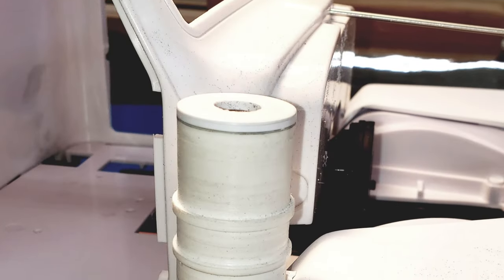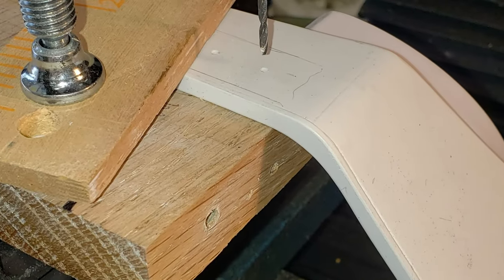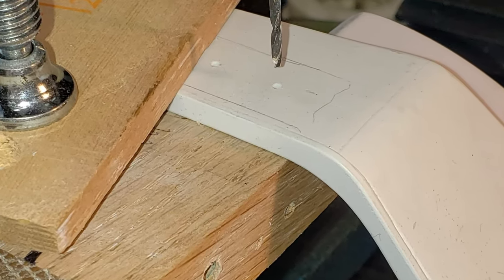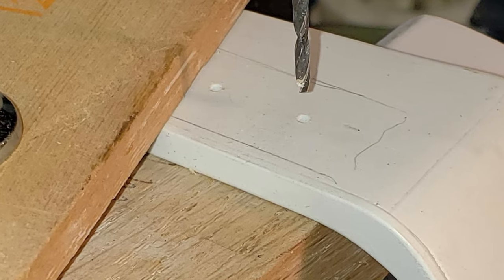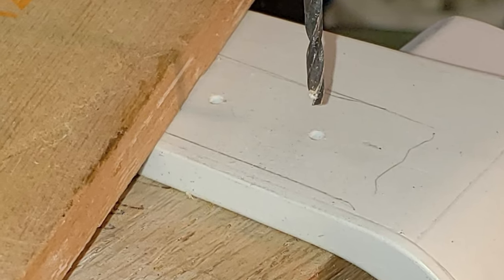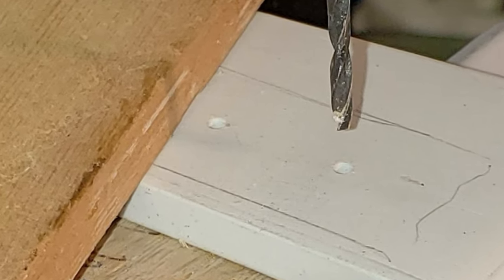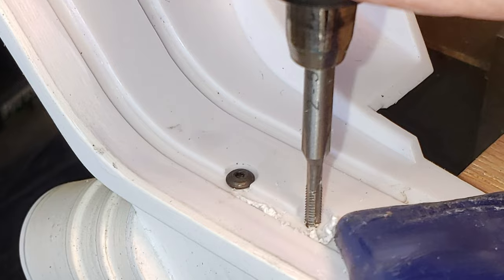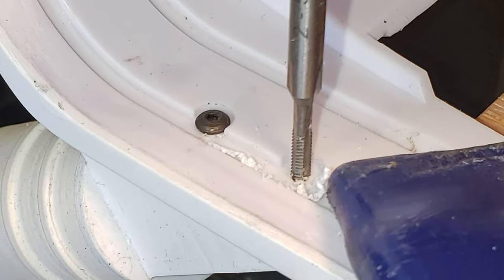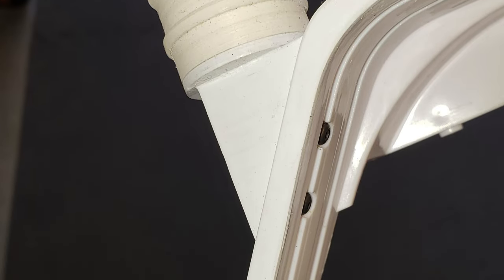The partially fabricated air filter was positioned, clamped, and marked on the right fender's trailing surface. The top one of two air filter mounting holes was then drilled into the right fender using a number 50 tap drill, and then that 2-56 tap drill hole center was transferred to the air filter's mounting plate, where the transferred hole was then tapped with a 2-56 tap. After mounting the air filter to the right fender with one 2-56 button head cap screw, a second 2-56 tapped hole was installed to finalize the air filter's alignment and mounting to the right fender.